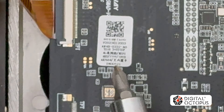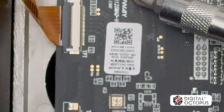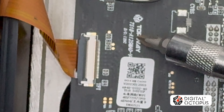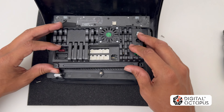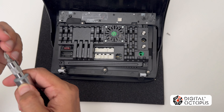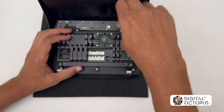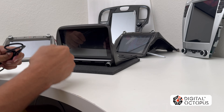This radio's sticker says TS18 3+32 — that's all we need to know. This tells us it's a CC1015; we're the only ones who made this configuration, the 3+32 for the CC1015. You might also have a 4+64 or 6+128 version, and it will say so right on the sticker. Also look for where it says 'Top Way' — that's the motherboard brand, and it tells us exactly which software to send you. Now I'll put the radio back together.